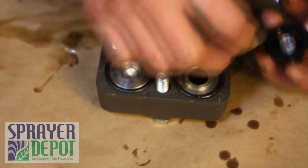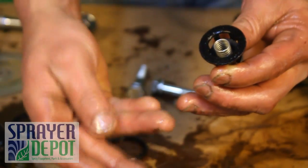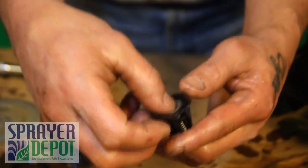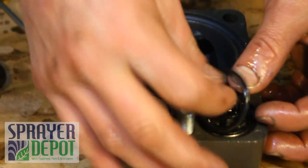On each side of the three outer head assemblies, remove the inside of the valve cage. Replace the spring, small seat with the beveled side down, and large metal seat. Replace the valve assembly back onto the head and replace the O-ring with a new one.